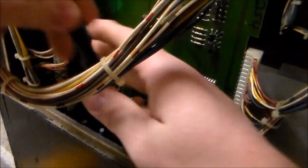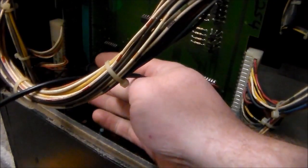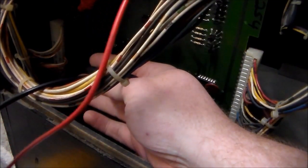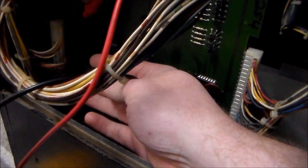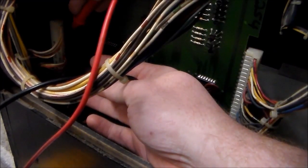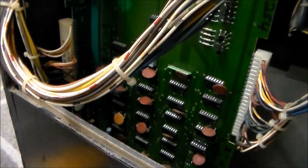I'm going to check on the board itself rather than the actual connector. On the ground and checking this pin we have 5.08V. Moving down to this one we have 12.02V, and this one we have negative 5.18V. So we have all of our voltages on the board — since the board is tripping, it's not a voltage problem.